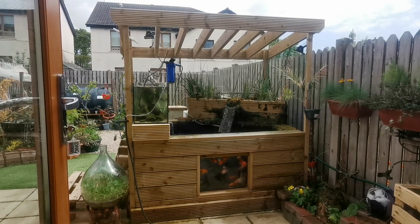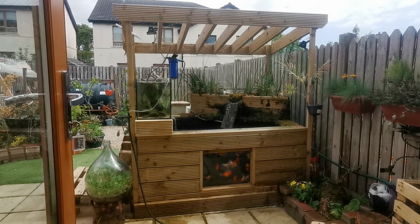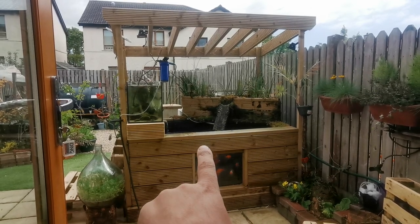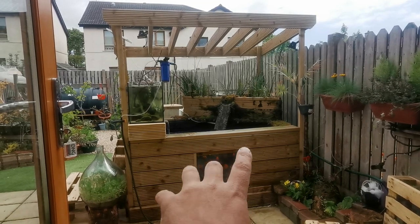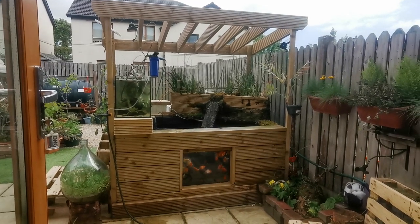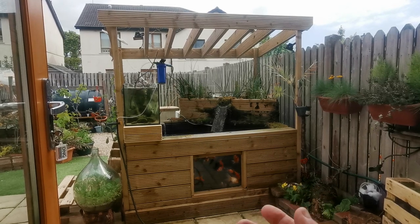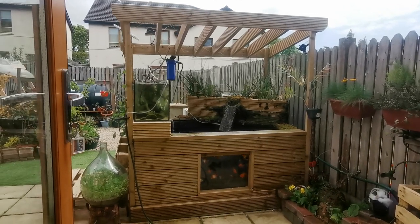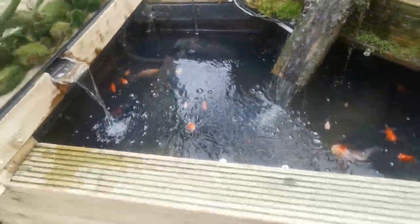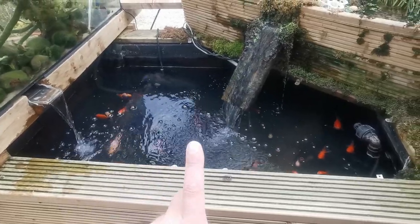This is a thousand liters. The reason I went with a thousand rather than 750 or less, or two to three thousand — I'd love to have it bigger, but heating a larger body of water would be an absolute expense. Another reason I made this tall is that I could put in a bigger volume of water with a smaller surface area, so there's less heat loss through the surface. Once the sides are insulated the heat stays in, but the surface is where it escapes from. A thousand liters worked out really nicely.